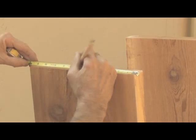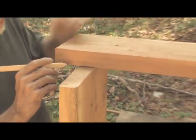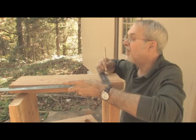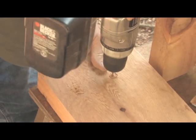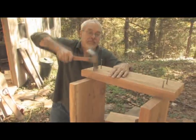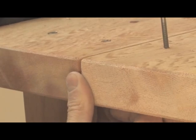Leave the center edges where the two parts of the top will meet only lightly chamfered. Mark a center line on the sides to help with the positioning of the two top parts. Mark the location for the nails and drill pilot holes through the sections of the top, using a carpenter square to help mark the holes accurately. Insert the nails in the pilot holes, then align one half of the top and drive them in place.